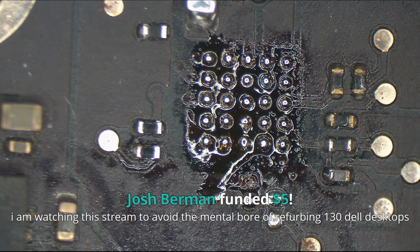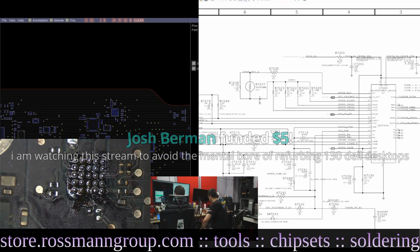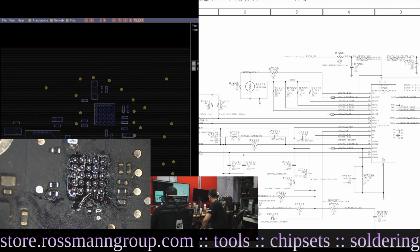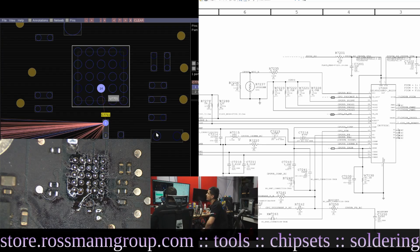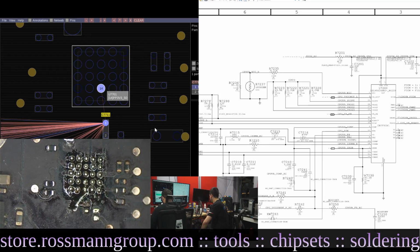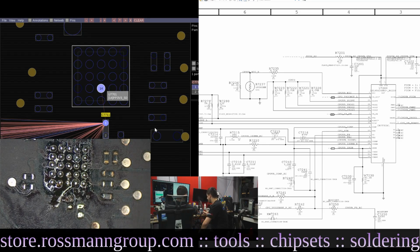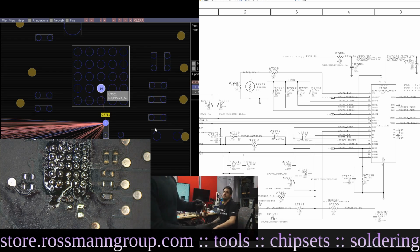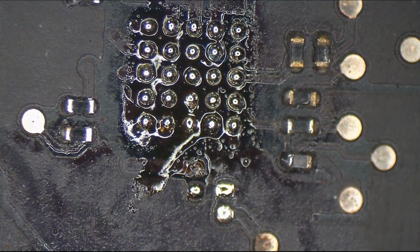Open with Sumatra. Let's get the multi-view. Okay, so you're missing this PP3v3SO, which goes to the middle. How could that go? It was pretty bad because this is it being removed, and you can see that's where it is, and the resistor that's right here is fine, but that one was just ultra destroyed. Now the key was what we were talking about with the enamel wire. The first question is, do you need it? Yeah, that was the main question because I just jumped to doing it and realized.